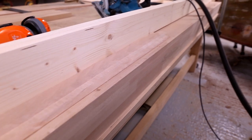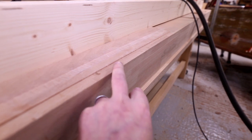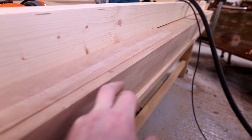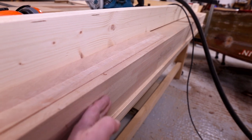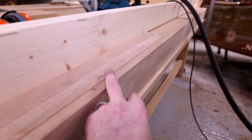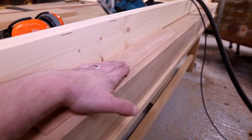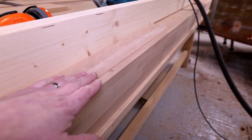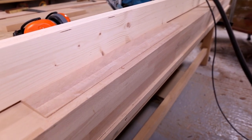So there's a look at the first cut. As you can see, because we're slightly back from the front edge we've got a bit of a step on the edge of the plywood. As the plywood comes further towards the front of the jig this edge will eventually go to a fine feather. You can either cut the scarf further back and then take it down manually, or move the plywood further forward for a complete feathered edge. I'll shift the plywood forward a little and take another cut.